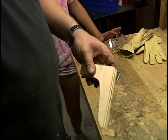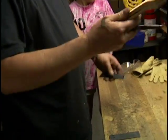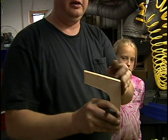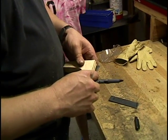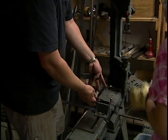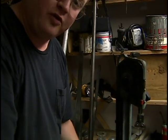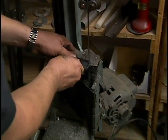I'm going to set that angle — it's 105 degrees, like so. This is a piece of wood that I cut in my miter box. Maybe you have a miter box or a chop box; it lets you cut specific angles. That's 105 degrees, and that's what I'm going to do here. I'm going to use the saw in the upright mode. I could spend a lot of time readjusting it to get the proper angle, but I like to leave my saw set at a really good 90-degree angle. It's really hard on this particular saw to move it back and forth, so I'm just going to do this by hand — you'll see it's pretty quick. You've got to hold the piece down while you do it.